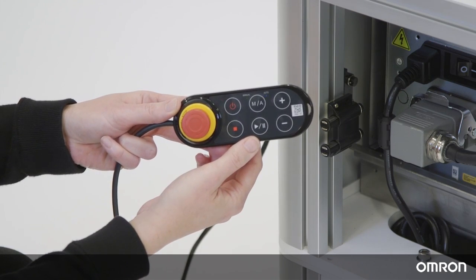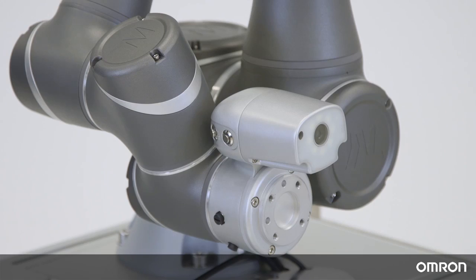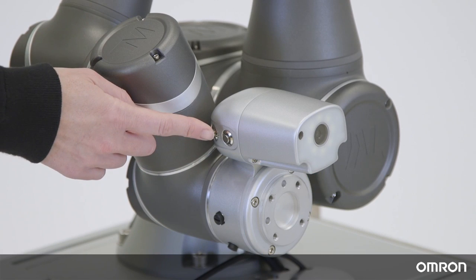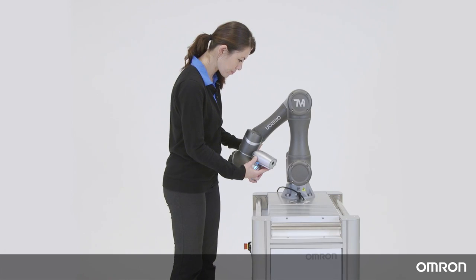The three lights on the robot stick will start to flash. The Cobot's ring light will turn from red to light blue, indicating that it has entered into a safe startup mode. Find the button labeled Free at the end of the Cobot's arm, and use this Free button to move the Cobot into the first-time startup position.